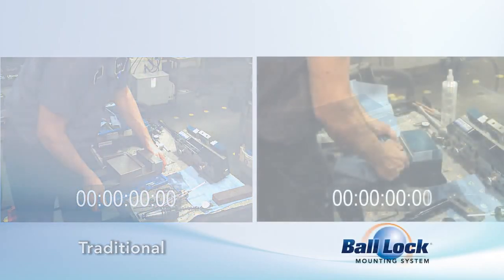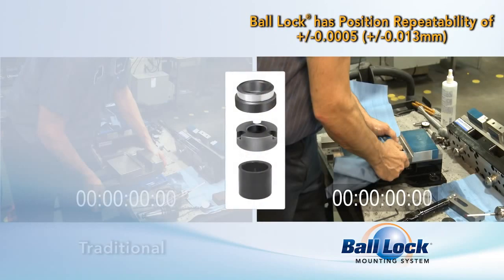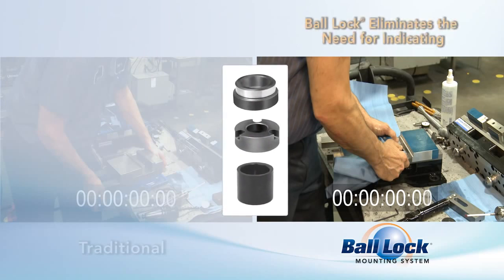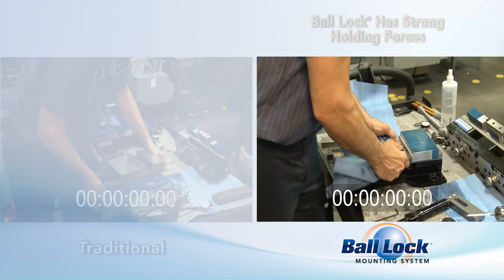On the right is the Jergens ball lock system. Once you pre-install ball lock receiver bushings into your subplate or fixture plate, you can easily mount a vise without indicating. To set up, the operator simply installs ball lock shanks in the jaw base of the vise and tightens them down with a hex key. Then, he loads the parts to be machined and he's ready to go.